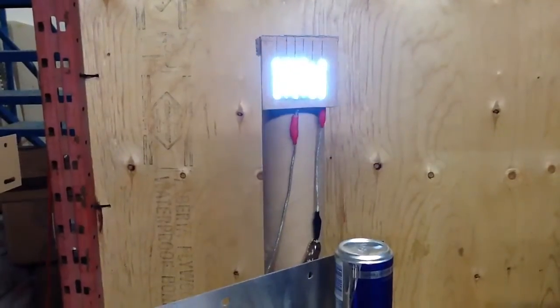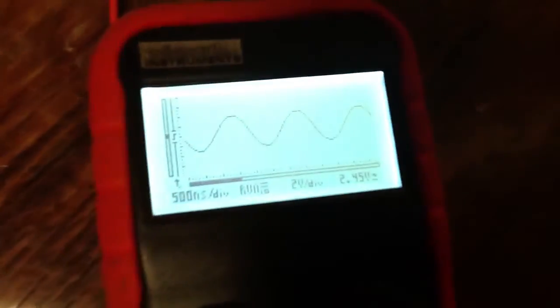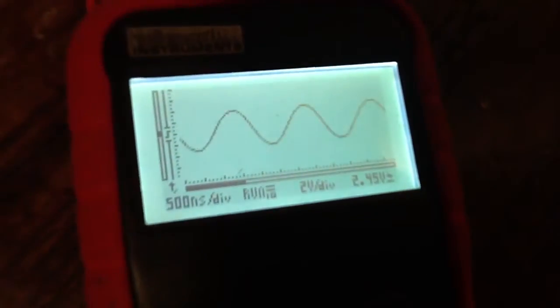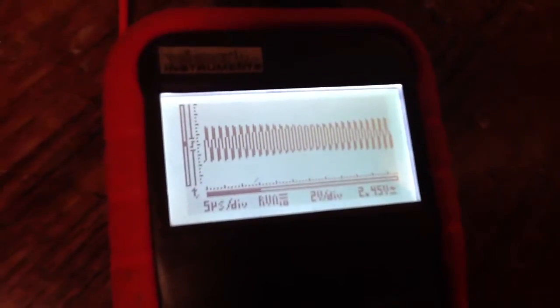It's really nicely tuned here. We've got the wave at about 500 kilohertz on the nose. It's fairly stable, and after I glued the top load down, all the noise went away on the screen here. This is just the probe sitting in midair, just far enough away so I can get it on the screen. Zooming out, we start to get this kind of wave in time — a pretty thick envelope at 10 kilohertz, from end to end.